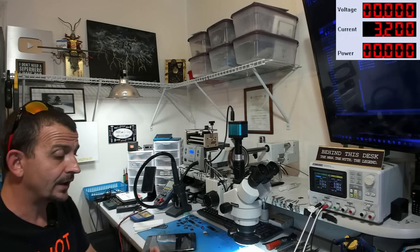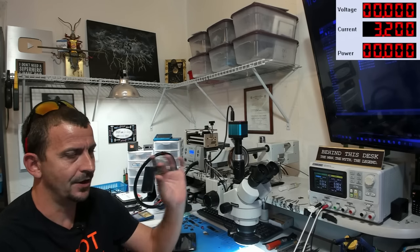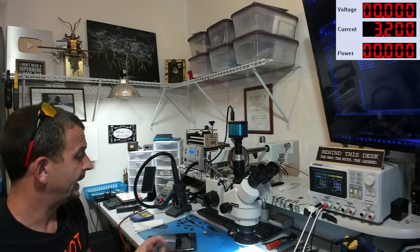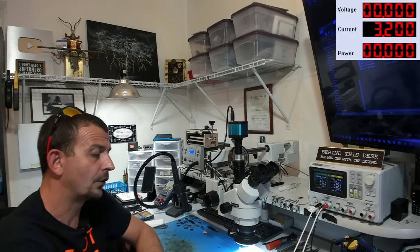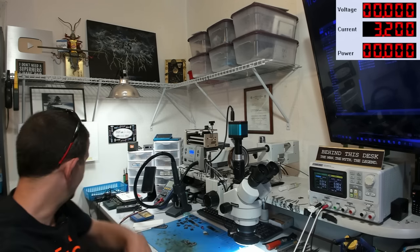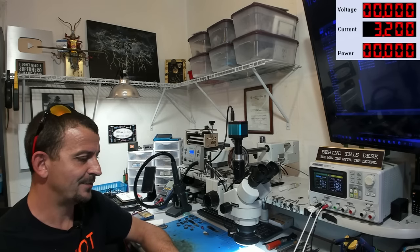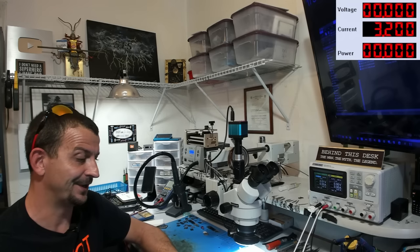What I've done here is I have taken a known good iPhone 12 Pro Max board, and I've transplanted the brains from the customer's board, and I've basically confirmed that there is a problem with the customer's CPU or the RAM. Wow, what a bummer. All right, everybody. Well, I'm not going to spend a whole lot more time on this video because that really hurts. That really hurts bad.